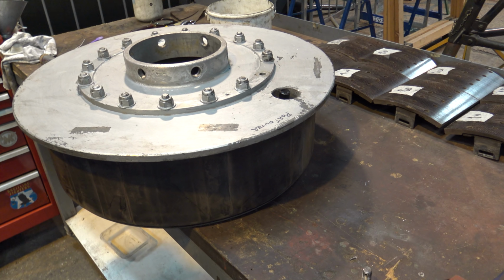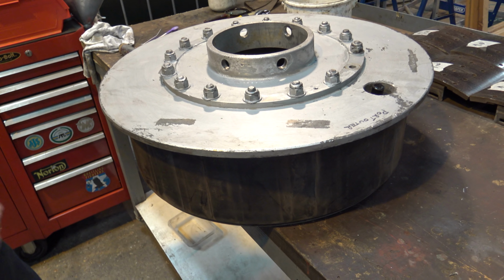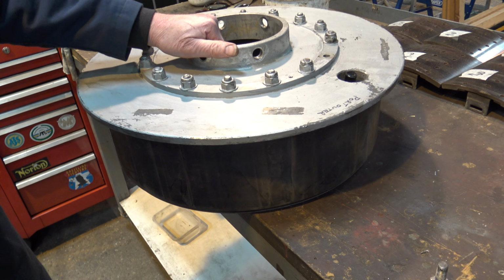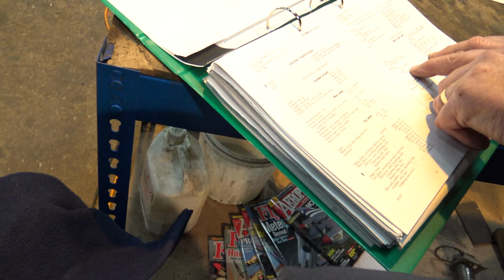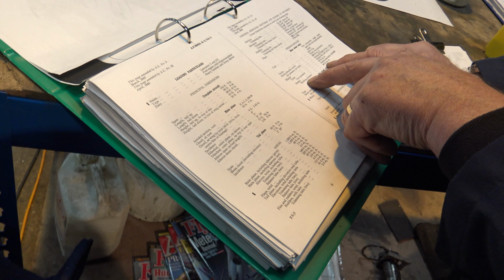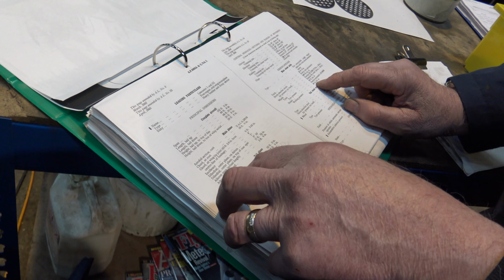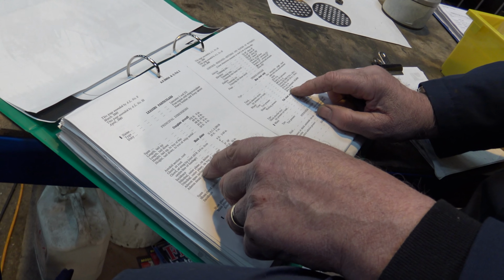I think the pressures were set too low, but just look at the book. Then it'll be a question of tweaking the valve up, the operating mechanism, to get the book figures. So the air cylinder, what sort of pressure does that have in it for the brakes? The XL's wartime pressure, the brakes were working at 80 psi. Yeah. PA474 down the road, when I was on it, used to work at 120 psi.